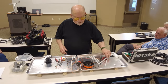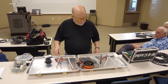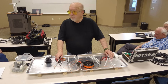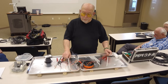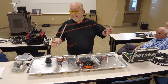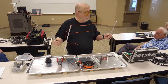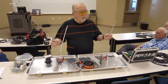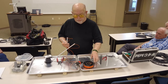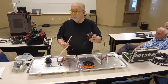So now you're going to go through and do the same thing again down here for 20 meters. Okay, and if you want to do 10 meters, you can go down here. You don't have to do 15 because you can run 15 off the 40 meter side of it. Now, the problem with this is that once you get all these things together, you gotta keep them tight, and that's what the problem is with the fan dipole. It's a pain when you get it up, but when you get it up, it works great. Of course these would be a lot longer. They would go down here to whatever center insulator that you've got, and they'd all tie onto here, and then you plug your coax into it and go.